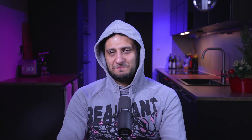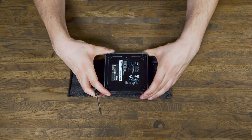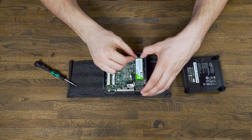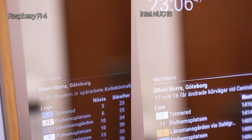So, I decided to go badass. This is an Intel NUC — it's a small form factor PC, a full-fledged 64-bit Intel PC. This particular model is an 8th gen i3 with an Iris Plus 655 integrated GPU. It's one of the weaker NUC models, but compared to a Raspberry Pi 4, this is a supercomputer. These NUCs come without RAM and SSD, so I added 120GB of SSD and 8GB of RAM. It can now play back a 4K movie while delivering a smooth browsing experience, and it delivers 60 frames per second animations and smooth transitions without any hiccups.